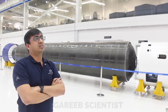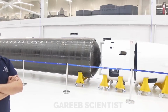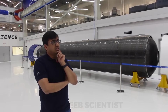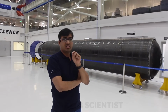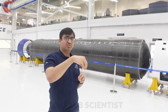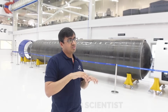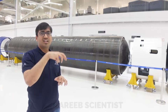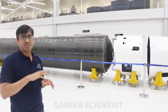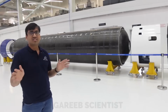Yeah. In fact, I think it took us 2-3 years just to master building these carbon fiber structures. Because we coded it from scratch. We actually give the M codes onto the machine. So we built software which gives the CNC codes directly, and that CNC code will wind the rocket motor. So we had to build everything from scratch, software and all. But we're happy that till now, every hardware we build has worked.